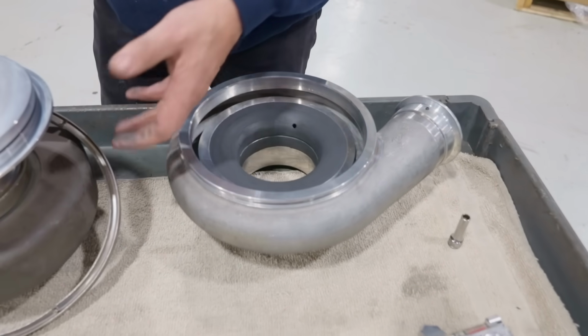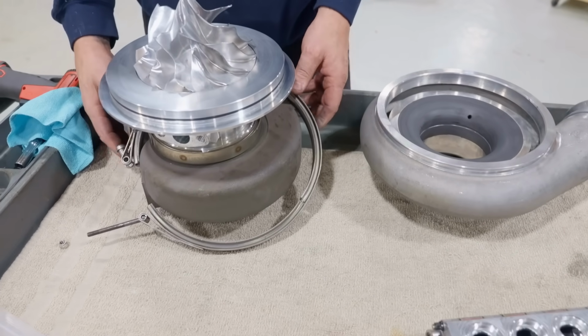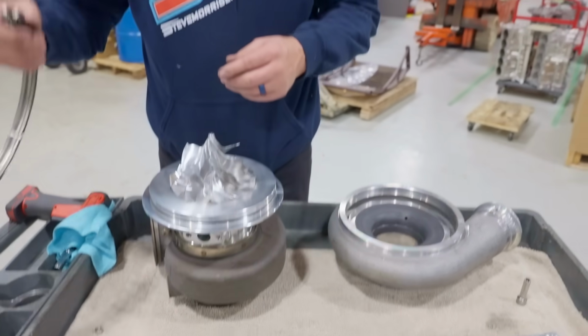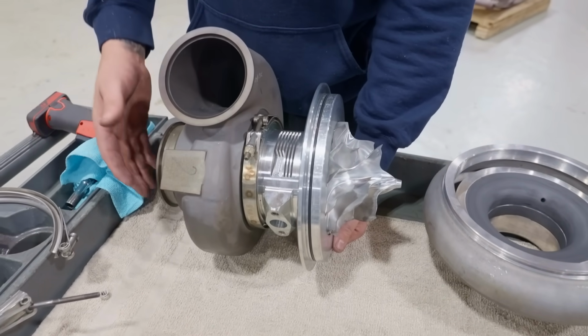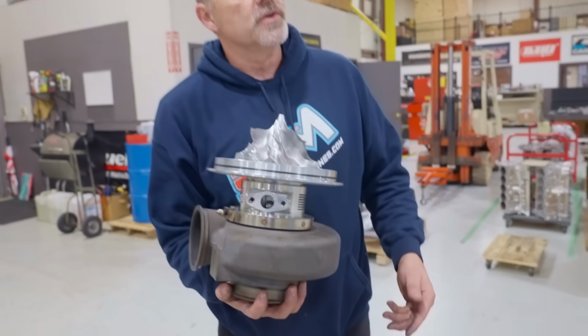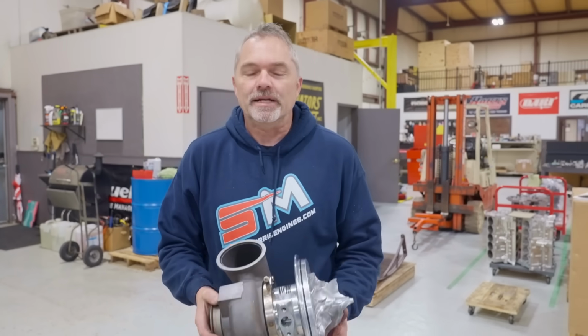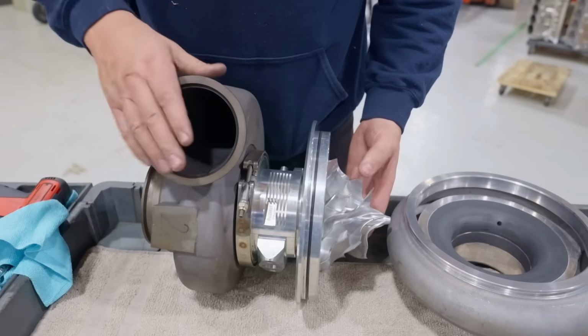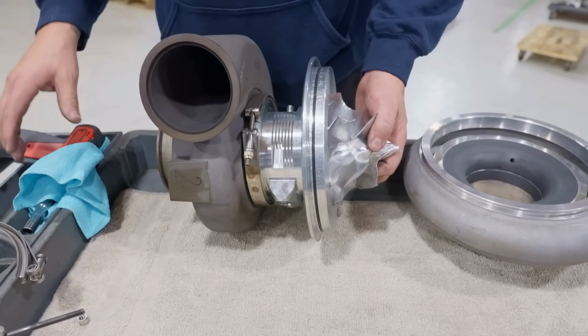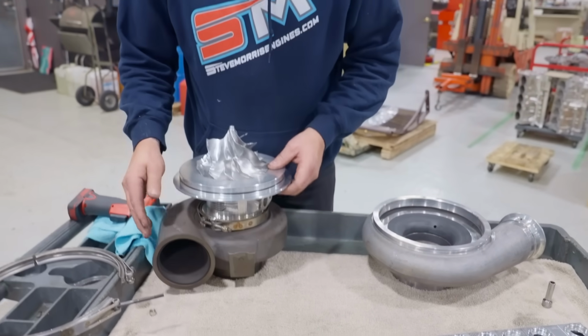Not heat resistant. There's nothing you can do on the turbine side. You're not going to have anything that stays in there that takes up that area. This is the really ultra lightweight one. If you remember, these turbos are 16 pounds lighter a piece than my previous turbos, because of this unobtainium exhaust housing here. Still really excited about that whole deal. Pretty darn neat. So anyways, that's going to be interesting.